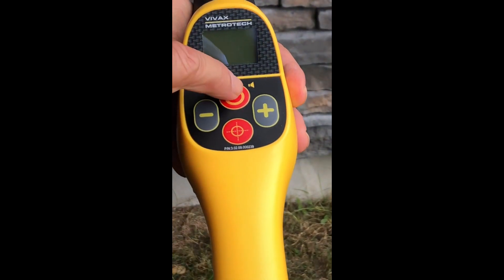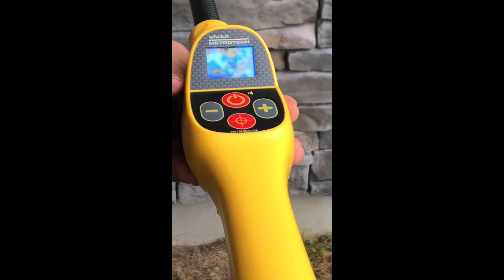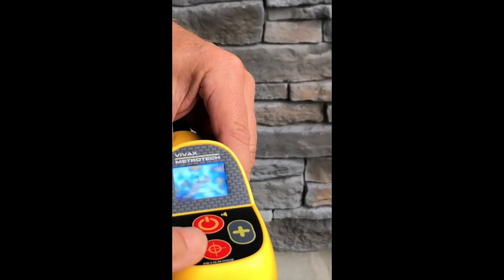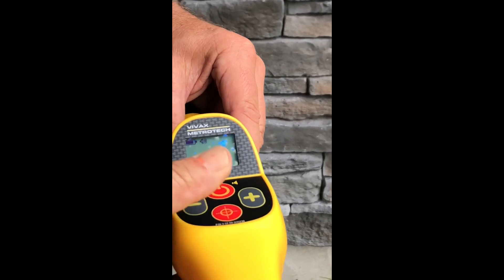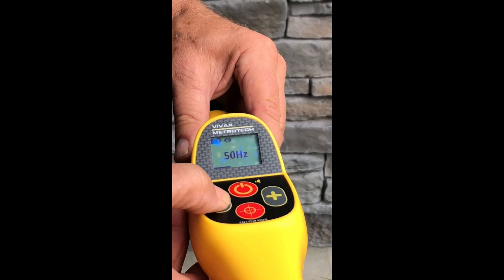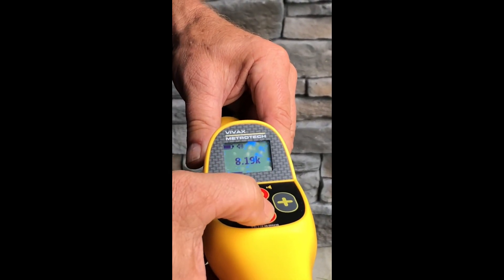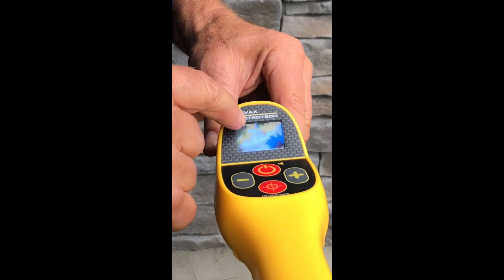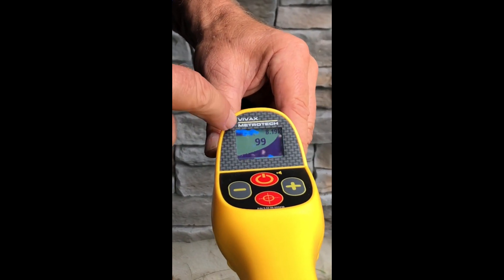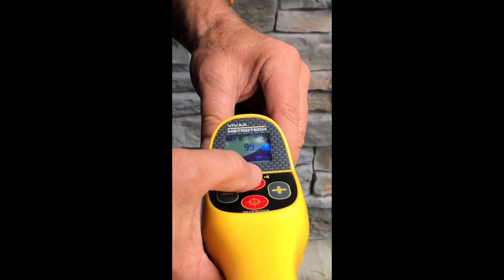Here's the universal on/off button. If I push and hold the button, the signal lights up. The last time this was used it was in 60 Hertz — we'll come back to that — so I'm going to switch to 8 kilohertz. To do that, you push this button here, push and hold it, 60 Hertz lines up, and you can change frequencies by pushing the plus or minus button until you see 8 kilohertz. To lock it in, press this button. Now 8 kilohertz is working. Sometimes the mute button activates, in which case there's a little X through the speaker icon and while the signal is still there, you can't hear it. To release the mute so you can hear it, push this button.